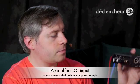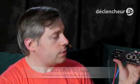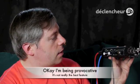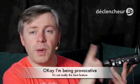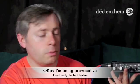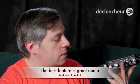I'm ready — I can turn it on. The LEDs do that little dance and I can just adjust the gain to whatever I want. You see it has this thing where it shows you the level and one LED remains at the top for a little while, so you can set the gains very precisely. Typically what I do is record interviews, so I would have the interviewee and the interviewer and I would want to have separate gains for each of them. With a DSLR, if you want to change the gain you need to go into the menu — here you just use this knob, so it's much more convenient. But if you want to use a stereo microphone, you don't want separate knobs — you want just one knob to control both inputs, and you can switch the mixer to stereo mode for that.